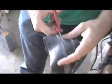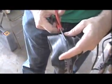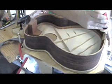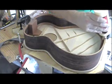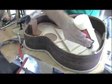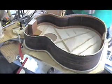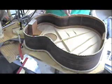And we're back and cutting this into 2-inch width strips. This will give us enough length to make one pretty long strap. And we're starting with the glue here. Of course, you want to cover the entire kerfing, neck block, and tail block with glue.